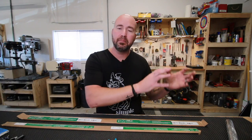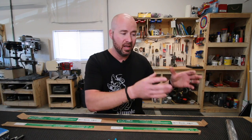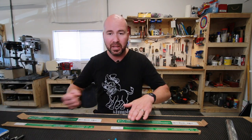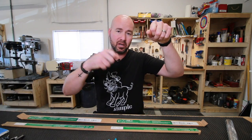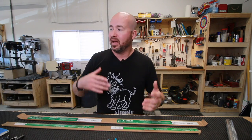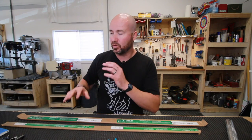And again, the reason people start with high carbon steels is because they're relatively easy. It's a lot easier to just get a bucket of oil, canola oil, vegetable oil, whatever, and use that for quenching than it is to go and find some aluminum plates and make some type of setup like this. A lot of guys will just hold the plates down and blow compressed air. Some of the stainless steels actually just air harden really well. A lot of guys just hold them up in the open air, blow compressed air around them, and they cool off very quickly and harden up just fine that way. And again, every different steel benefits slightly differently and acts differently to different ways of quenching.